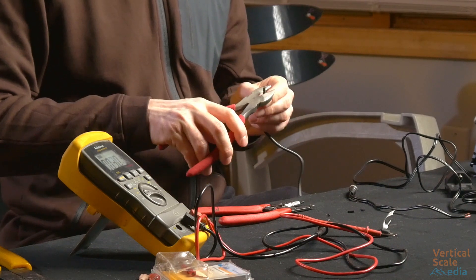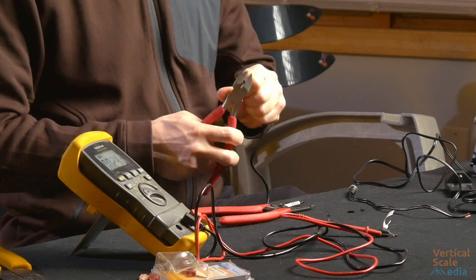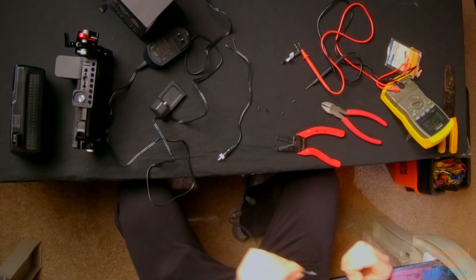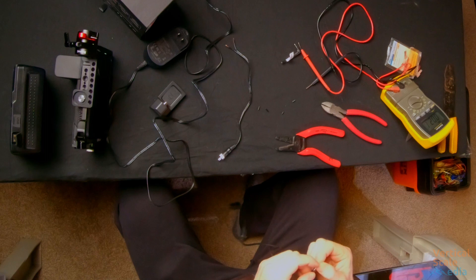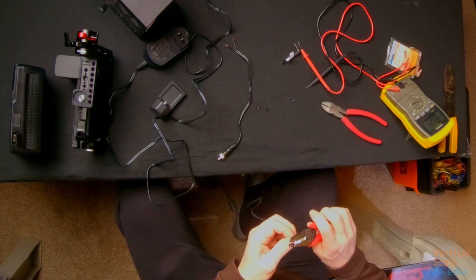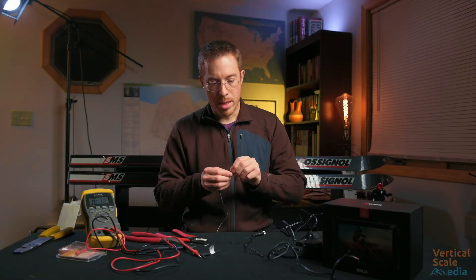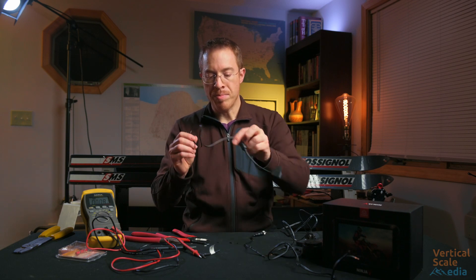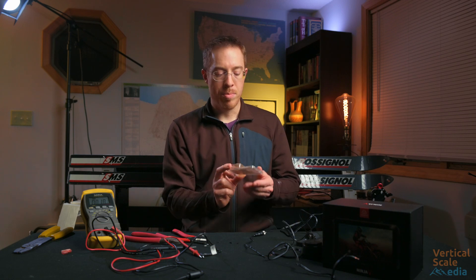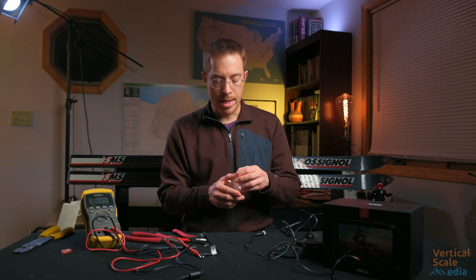This one is a little different — it has a jacket around two conductors. We're just going to try to cut into this sheath a little bit and eventually pop it off. Let's make sure we didn't nick the wires, because we don't want bare copper that could short something out. Looks good. Now we're going to strip these as well. These are a thinner conductor, so make sure when you get connectors like this that they will actually accept a small wire like that.